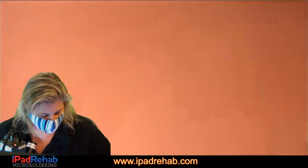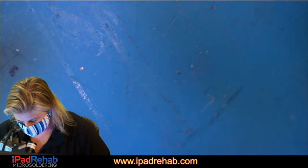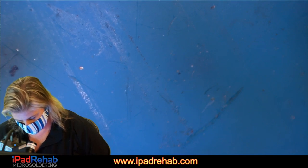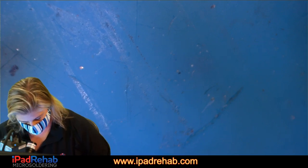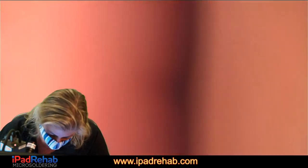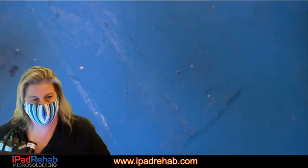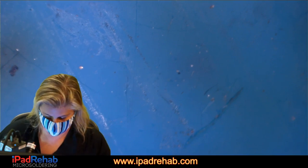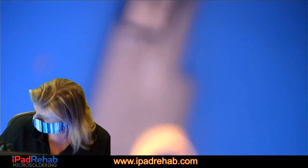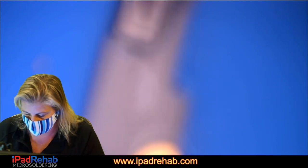All right, let's check. Do we still have a 200 milliamp leak? And if so, we might have to see what happens if we just try to ignore that leak, because our main power rail is okay. All right, our leak is now 186 milliamps, and I think we're still just looking at the same thing with heat. I think we can stop looking around for heat.